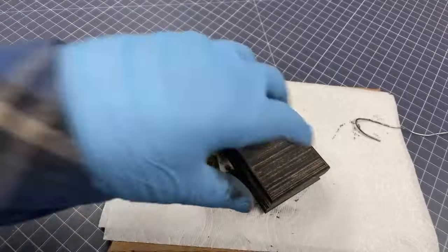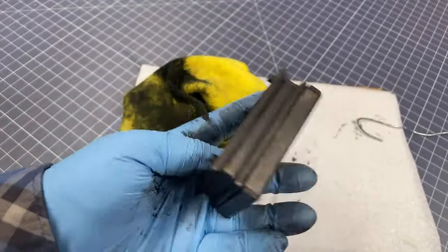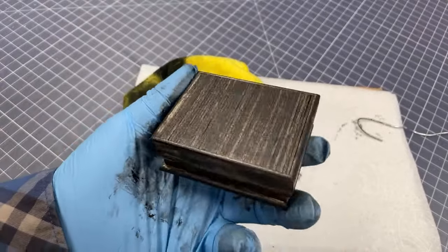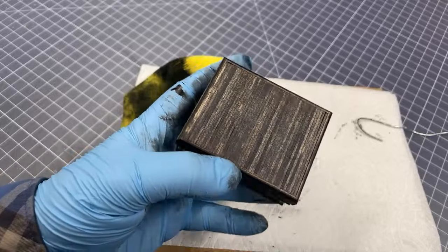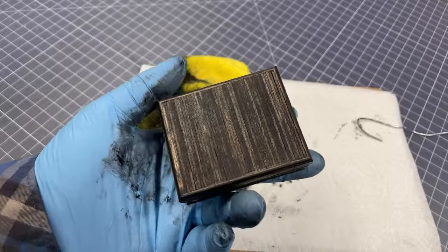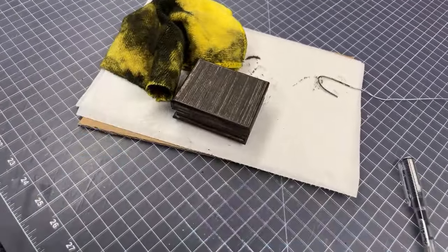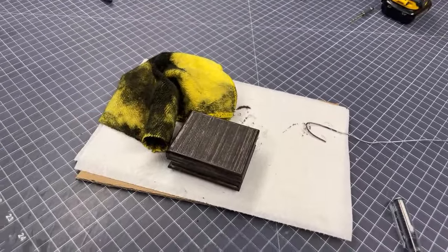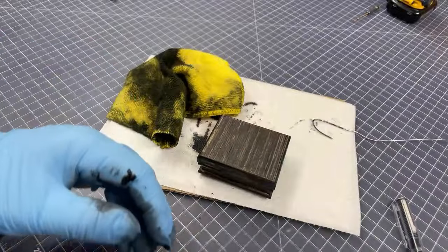Just a caution, because I've actually been in shops where smoke has occurred in trash cans, and I've seen fires occur in other videos where people have made mistakes. So just be careful. These solvents that are in this wood, even though they're natural, can start fires if they're kept in a confined place, or they let off too much gas and create a chemical reaction to themselves. So just be careful.